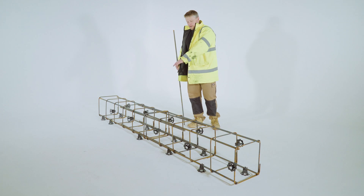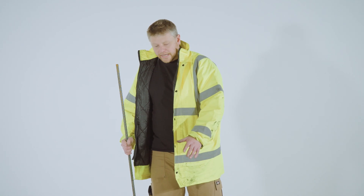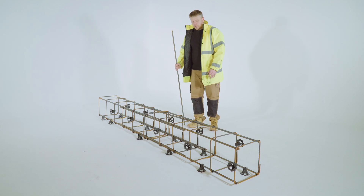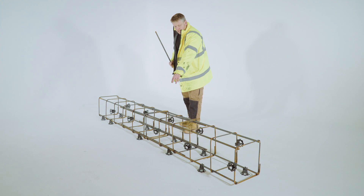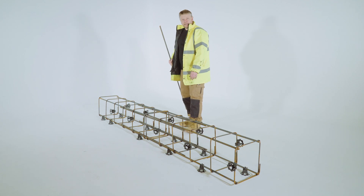So we've got our two one-and-a-half metre long cages that we've just butted up together. We then need to join these cages together, and for that, because these are 16mm main bars in the cage, we join them together with the same. This is a 16mm splice bar. We've already started tying these together with tying wire. There's still one left to do so I'm just going to show you now how we tie it.